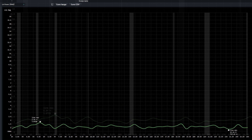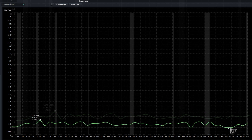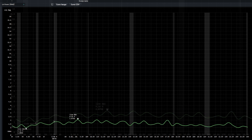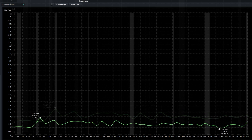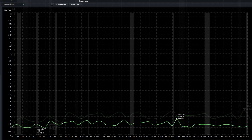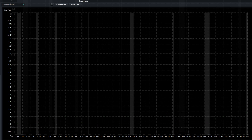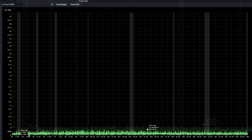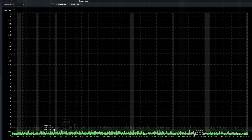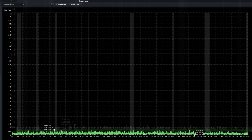So here's the question: do you want something that looks like this making noise like this in your radio room? And this is just one — what if there are 10, or 20, putting out significant signals in the HF range? I've slowed the sweep down to better display what's going on. The best way around it is a power supply that has a transformer in it and is not a switch-mode supply. If you haven't subscribed, please do that. I'm Jim W6LG in Rockland, California, looking at all of the noise sources in my radio room — and there are plenty. 73, see you later.